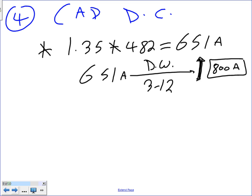You need an 800 amp disconnect, but a fuse of 600. Can a 600 amp fuse fit an 800 amp disconnect? Yep. They want the disconnect actually to be high because if somebody like yourself doing maintenance and electrical work goes and disconnects the capacitor energized, they want the disconnect to be able to handle the interruption of the current for that capacitor.